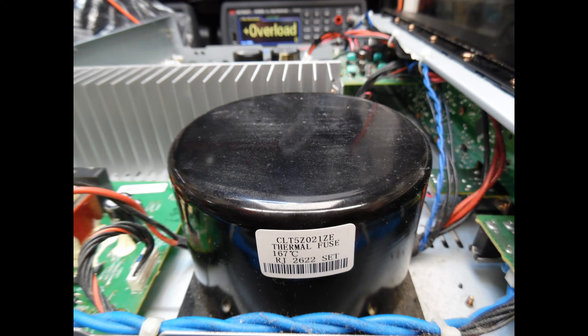So what you do is unplug the secondary connections from the amp board. We always test amplifiers via a dim bulb tester — I'll put a link in the description to a video I made — and we have a 60 watt filament light bulb effectively in series. We then power up the amplifier after replacing the T1.6 amp fuse. As soon as we did that, the bulb lit very very brightly, telling you that the failure has nothing to do with the secondary side of the transformer — it's the primary side.